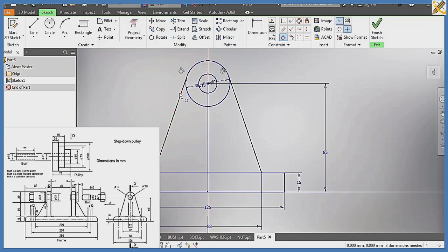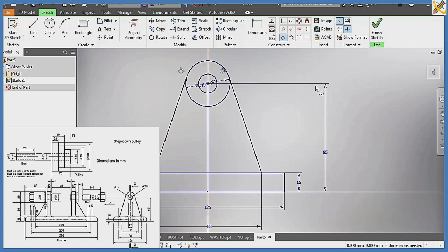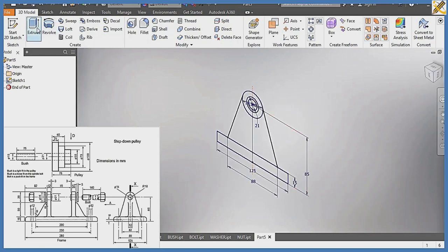That being settled and done, I think somewhere towards the back, if you look at that other view, one area comes out with a length of 3, and that area is diameter 21. So picking my circle from this midpoint, switching off the hidden line, from this center, a circle of diameter 21. Enter. Then finish sketch. After finishing my sketch, I do the positioning this way.